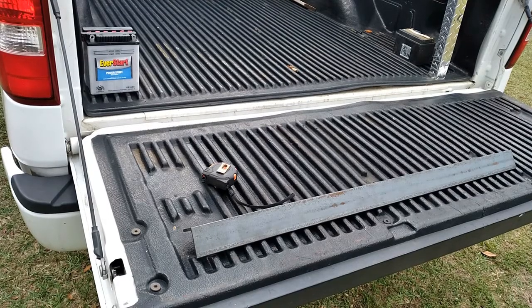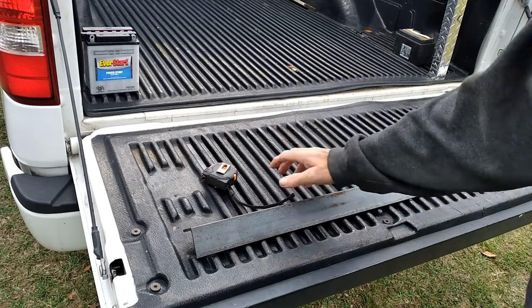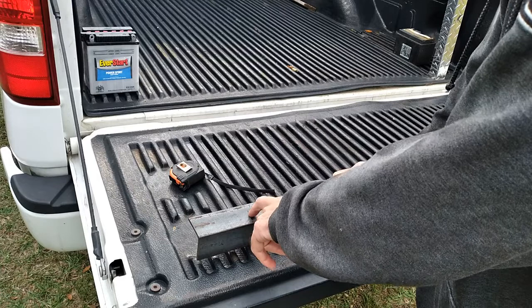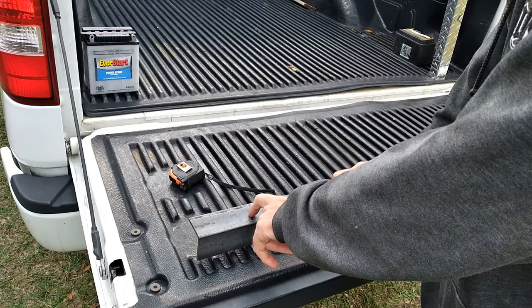Hey there, I need to make this puller for the sleeves — to pull the wet sleeves out of a '51 Farmall Super A, 113 cubic inch motor. Just using some angle iron I bought for something else. I need about 8 inches off of this thing to start with. The idea is I'm going to cut off the 8 inches and make the center hole about 4 inches in — right there is our mark.